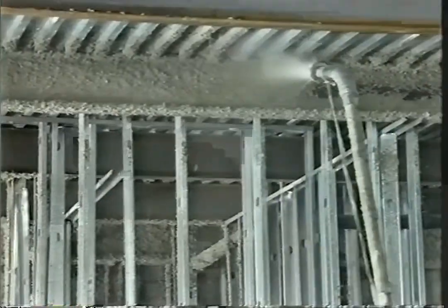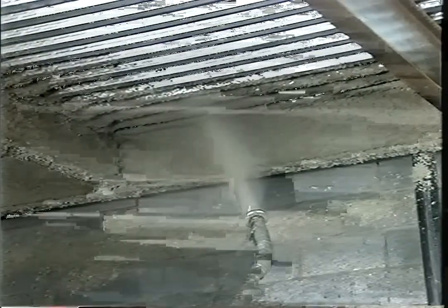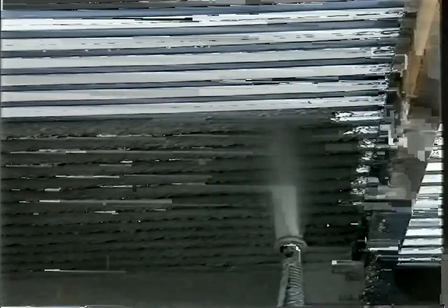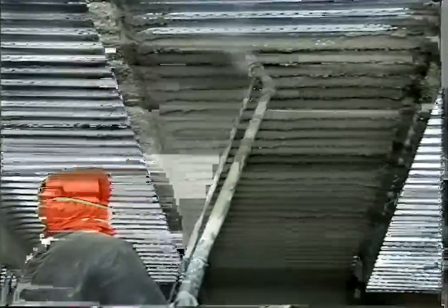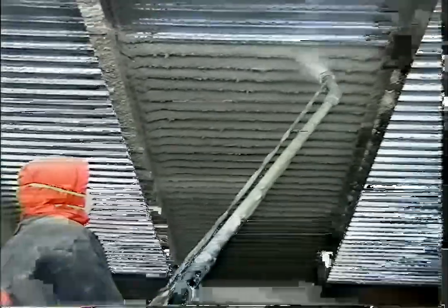Proper application depends upon fundamental spraying techniques. The nozzle must be held perpendicular to the substrate at a distance of 18 to 24 inches when applying Blaze Shield II. For fluted decking, Blaze Shield II is applied to the risers or vertical portions by moving the nozzle along the length of the deck no more than 12 feet per pass. The nozzle should be held at an angle of 20 to 30 degrees from the vertical. Each successive riser is done in turn. Ideal situations allow the sprayer to move backwards for a better view of the operation. Caution must be exercised when the sprayer nears the edge of the building; make sure safety lines are in place around the building periphery.